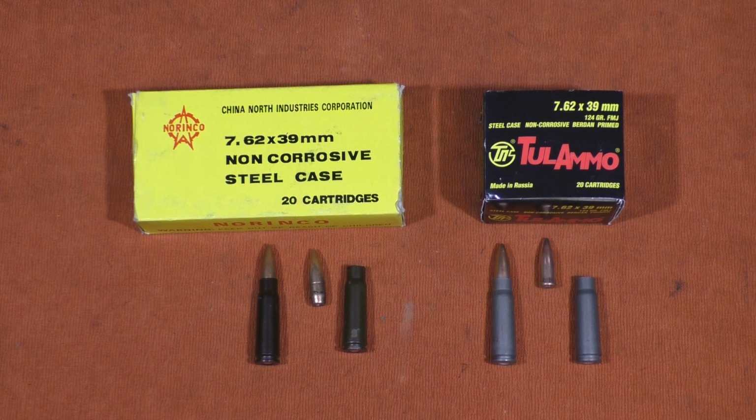different distances, you know, the 100 feet with the mild steel, 150 feet with the 1/4 inch AR400, and then the 185 feet with the 3/8 AR400. The reason why I chose to use 1/4 inch and 3/8 is because there'll be a different reaction between the two materials just because of the thickness. Now, I could have also shot a 1/2 inch AR400 target, but the difference between the 3/8 and the 1/2 inch is insignificant, so I didn't see any reason to do that.